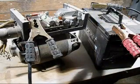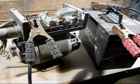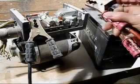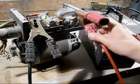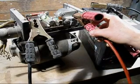After I checked the fuses, I wanted to see if the motor was going. So what I did, I connected up a 12 volt battery, but because it's a 28 volt system, the contactor won't work. So I bypassed it, and we'll do it now, and we'll try it. Nothing there, and the motor's working.